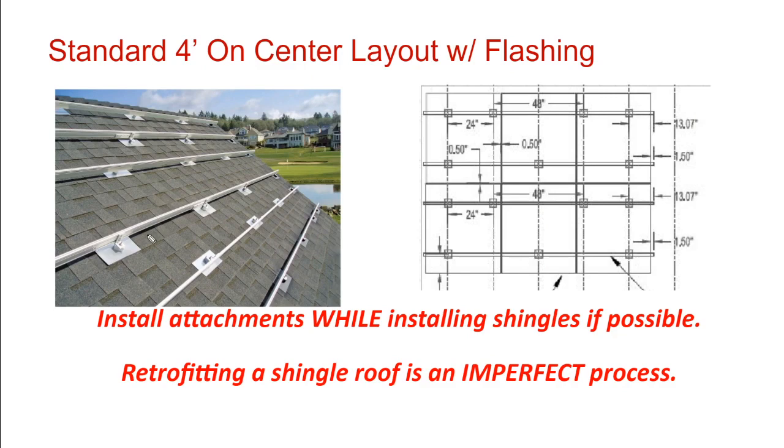And so this is actually a nice, enjoyable part of the job. You've already done all the shingle prying and very careful lag screw placement, and now you're just ready to put on a bunch of solar panels. They just get slapped onto this rack and then clipped down, and then the next one gets added, and then you screw in the mid clips, and then you prep the next clips, and then you add the next solar panel, and you just march it all the way down the rooftop.